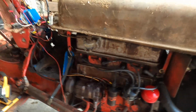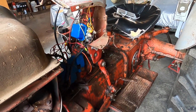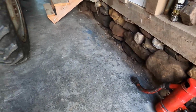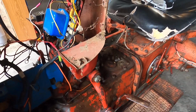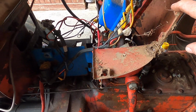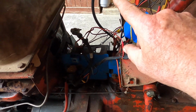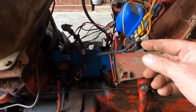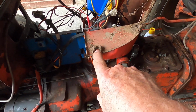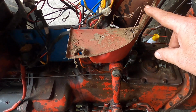And then you need to take the air filter mechanism out. That gives you more room, because after you take out the 1, 2, 3, 4 bolts on each side here they tell you about, there's 2 more right here, and these are capture nuts. If any of yours are left, you can see here in mine, the capture nut's gone, so I had to make something, and here's the capture nut. It's still there, still there.